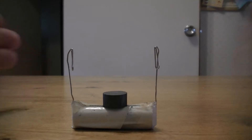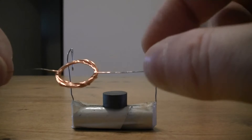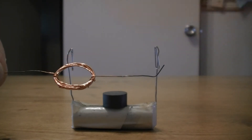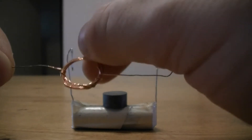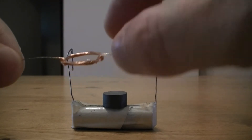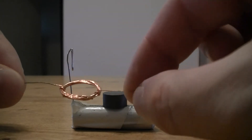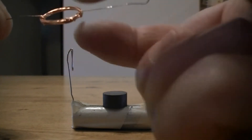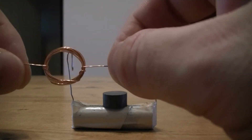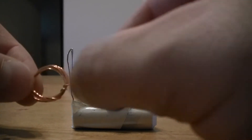We want to get power into our coil. The coil is made from 0.4 millimeter enameled wire - the enamel coating means it doesn't conduct electricity through its casing, which allows it to produce an electromagnetic force. We took about 40 centimeters of wire and wrapped it around the battery ten times to make our circle, then carefully removed it. Try to get it as balanced as possible.